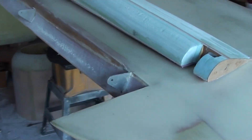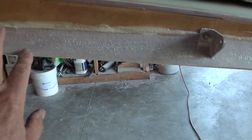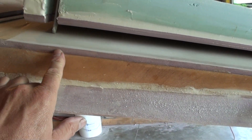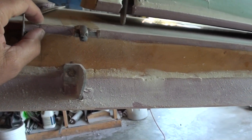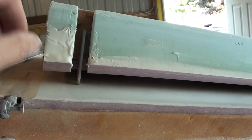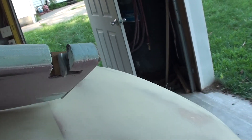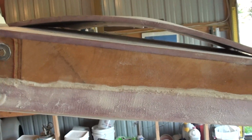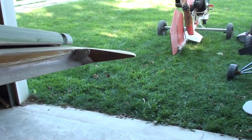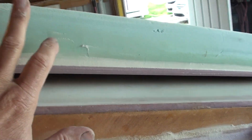What I didn't tell you last time: after I got all the glassing done, when I put the ailerons on to clearance all this stuff out, I noticed that because of this thickness here, when I made the plywood templates, they were literally the size of the spar. What happened was I ended up being about a half inch short. So what I had to do is add a half inch — as you can see in this piece of foam — tapering from a half inch down to zero on one end to get it to match. And then also this first section of flap was the same way. On this wing there's only one plywood template at the tip, so both the aileron and flap came down to a half inch low. I had to do both the ailerons and the flaps.